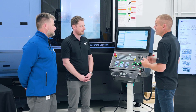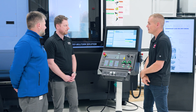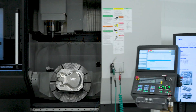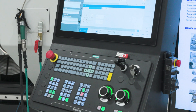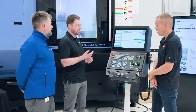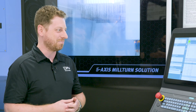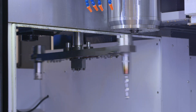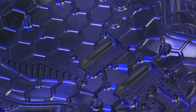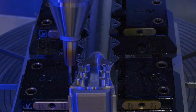The Siemens control on this machine is really great. I'm excited about it — it makes the job so much easier. There are so many features: intuitive probing, tool setting, and even tool breakage detection, which we're using extensively on this project. It's very quick to set up, whether it comes from CAM software or you can even add it on the controller itself to any program you have. It just makes that tool checking so much easier.